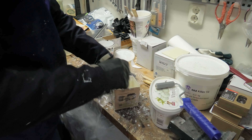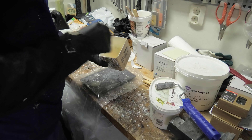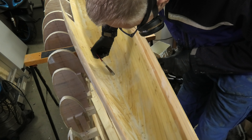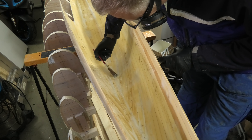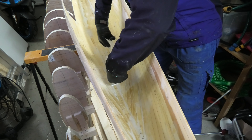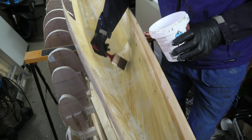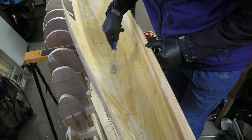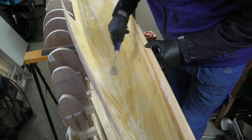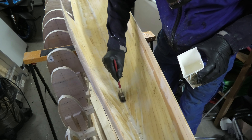I lower the temperature to shrink any trapped air — laminating at a shrinking temperature will reduce air bubbles. I will use somewhat thickened epoxy for this cover-up project. Thickened epoxy stays better inside the laminate, further reducing the risk for new air bubbles.